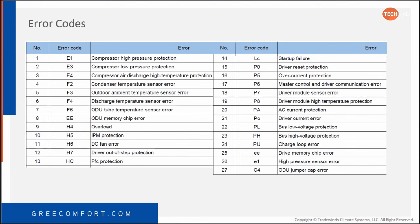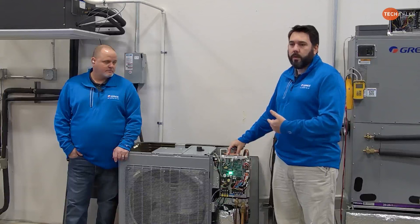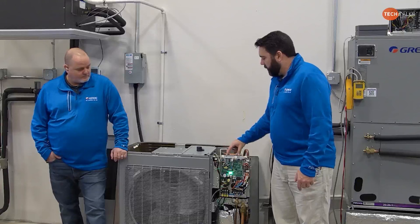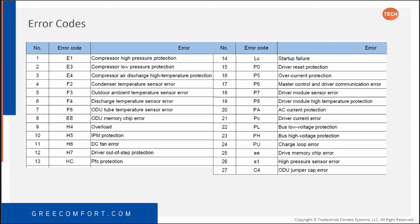Well, on the outdoor Flex unit, it's not communicating with the indoor. So the only thing it can be talking about is the outdoor fan motor. So an H6 on this is going to be outdoor fan motor. An H3, an H5 is the same. I think L3, H5 and H7 are the same as they are with the mini split.